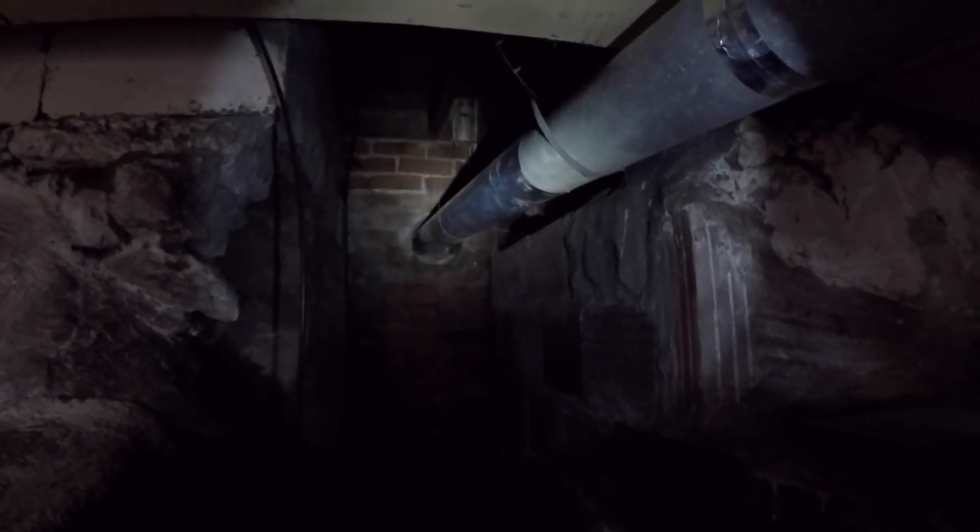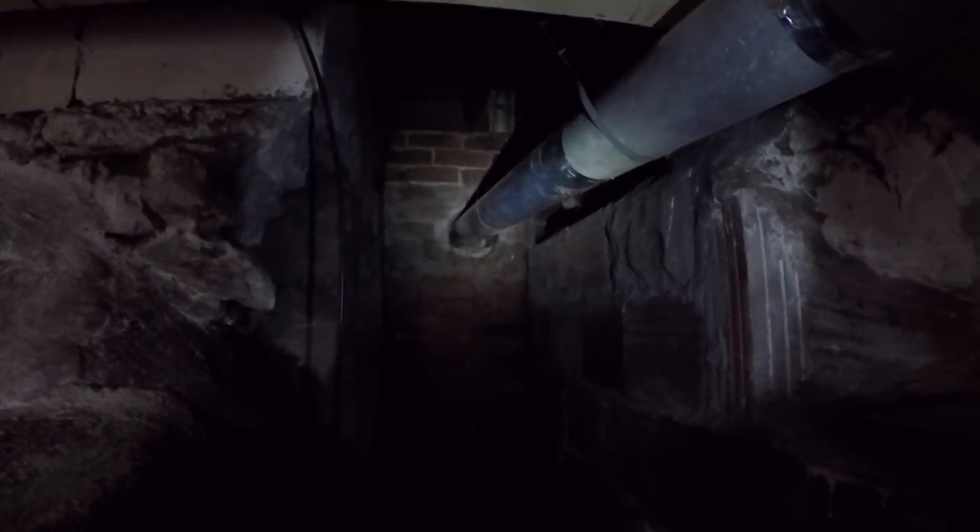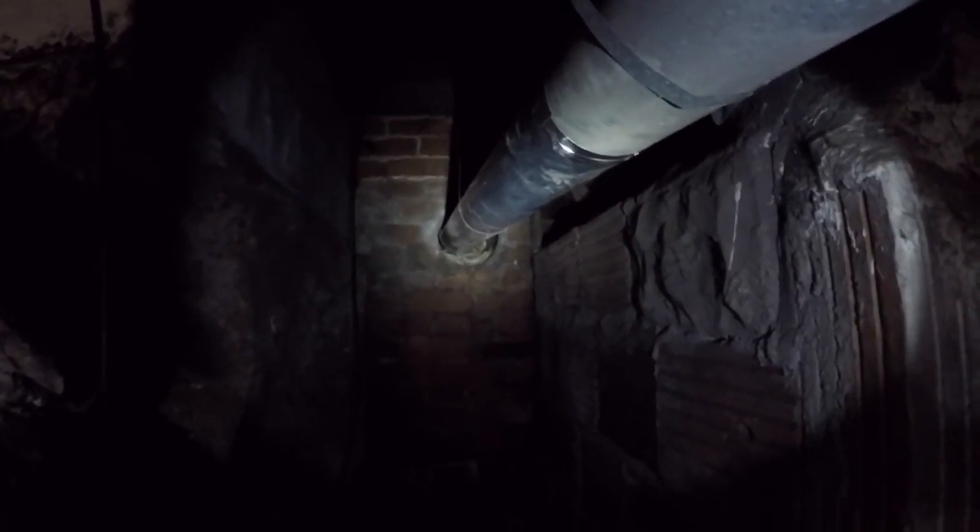That's fairly common with this galvanized steel pipe for furnace exhaust, from what I understand from the research I did. The elbow was completely gone so I had to redo this. I kind of did it in a rush because they were working on the roof and it was going to rain the next day. I ran down to the hardware store and bought this new pipe. After I got it done it looks good, but I regret going with the galvanized steel — I wish I would have gone with aluminum pipe because aluminum won't rust.